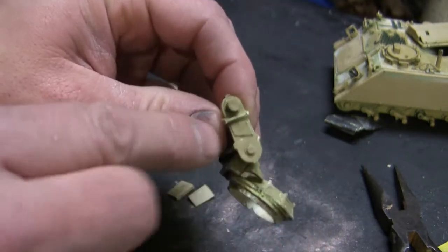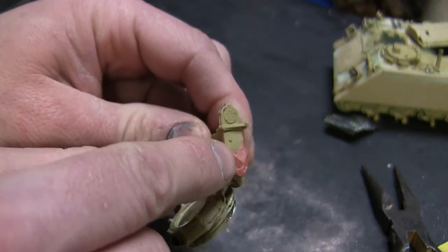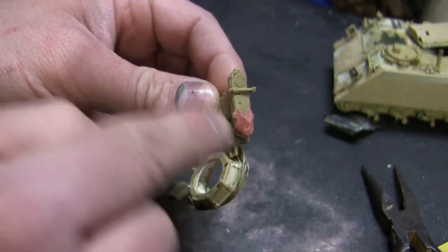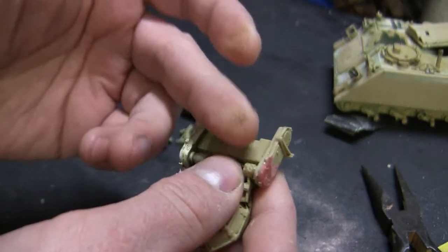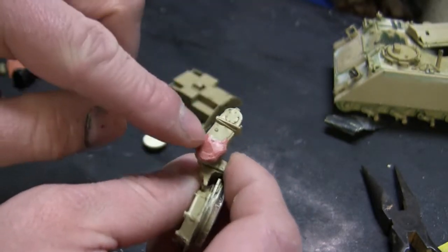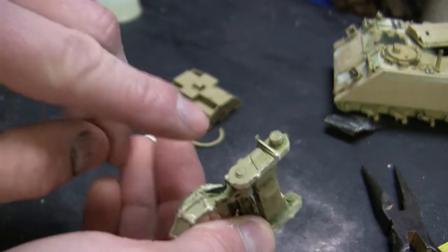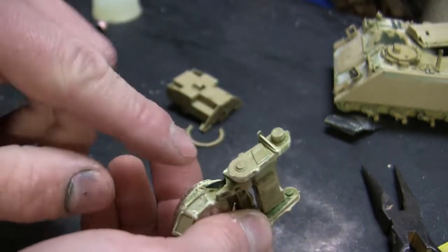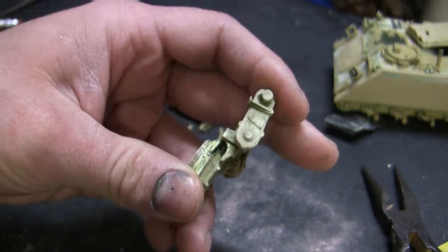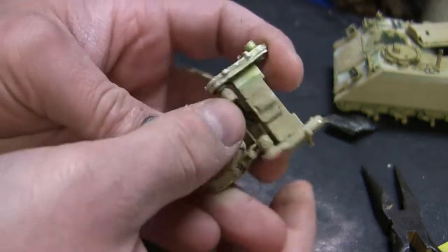Basically, that molding and detailing, like we see over here, was sanded away with a needle file, and the area was filled in with the red putty. The red putty is going to fill in all the cratering that occurred from the deformation, and now I'm going to sand it down with some needle files and some sandpaper in order to level it off. As for the detailing, I'm going to do one of two options. The one option is to just fabricate a new piece here out of a stock of resin. I turn it on the lathe and it'll give me the shape. However, you're not going to have those little fine details on it.